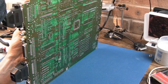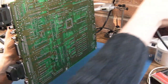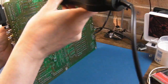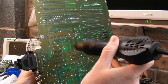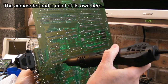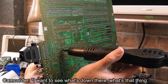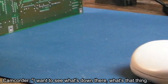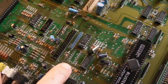You saw the tool I was using there just to grab that chip - gripping it pretty firmly. Bringing the hot air in at 400 degrees - let's just preheat around here. I'd like to try and avoid delamination, but this board has suffered from delamination in the past. Zooming in on the IC and pulling at the same time - there we go, it's coming out. The pads are okay as you can see.